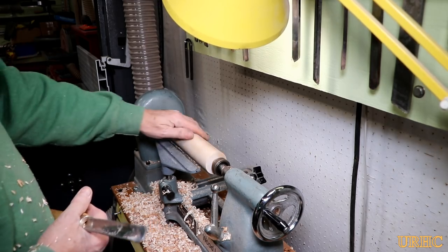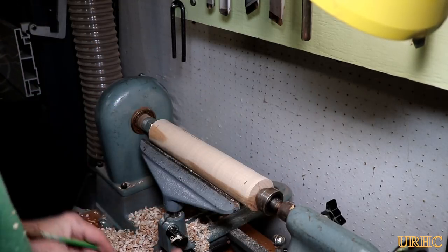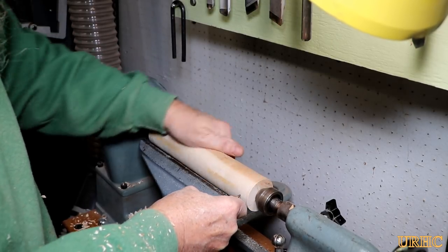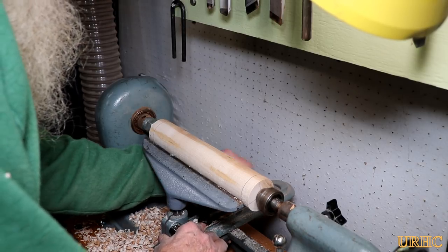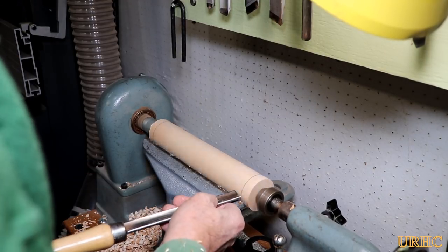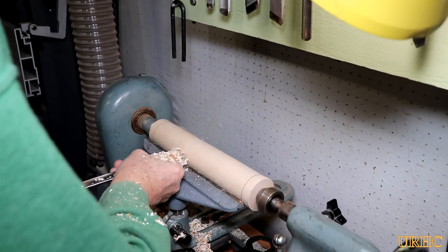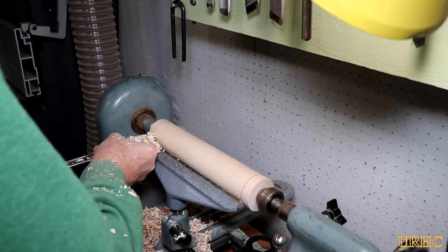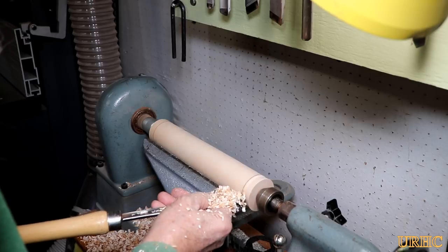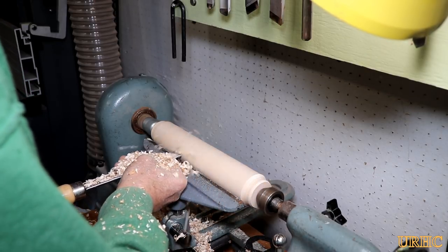You really have to keep one hand on the handle of the chisel and the other one up near the front, so you always have a good idea that your hands are not in danger. Now I'm just putting a couple of marks on there to mark out the overall length that this one's going to be. I just took a pencil and put that on there, then moved the tool rest in a little bit further. And now I'm going to do a little bit of final straightening up and also try to put a slight radius on it, starting to cut those end pieces off to the proper length.